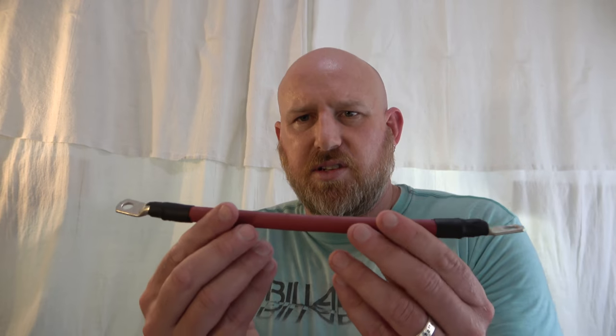And now that I got everything set up, what I'm going to do is start building the wires for the inverter first. That's the more challenging one. The battery is really simple. There's going to be about 7.5 inches between each terminal. But with the inverter, I'm going to have to make the positive one a little bit longer. And I've got to use two different terminal ends, because I've got two different size lugs that I'm attaching it to. And then I'll build out the battery ones.